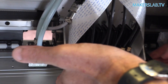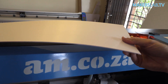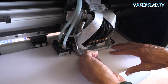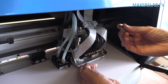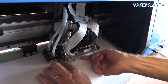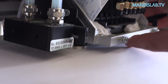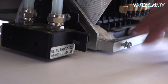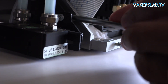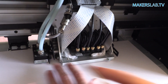You don't want your head crashing into the print bed, so hold that up. Use the thickness of the substrate we're going to print as your guard. Slide that in under the head, then two 5-rand coins is as close as you'll get to the correct height that this head needs to be. Position these just under the carriage and allow the print carriage to drop down onto them. The head's in the middle so you're not touching the head. Now just re-tighten the four screws we loosened earlier.